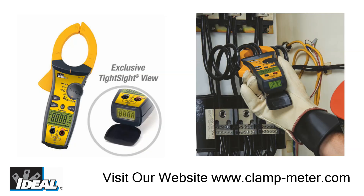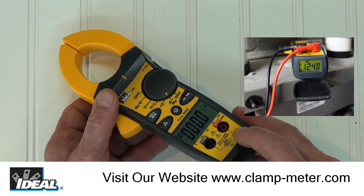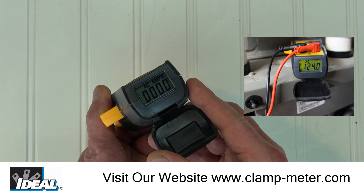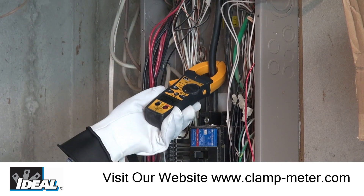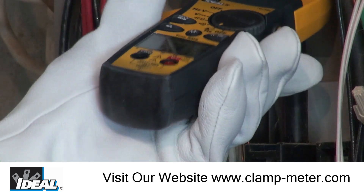Perhaps the safest feature of this CAT 4 rated meter is its secondary display window, which saves the user from having to twist a meter around a live conductor or even lean into the cabinet with their head to read a displayed value. Simply set the meter for AC amperage, clamp around an active conductor that is carrying a load — often deep within a panel — and open the bottom or end cap to reveal the second display.